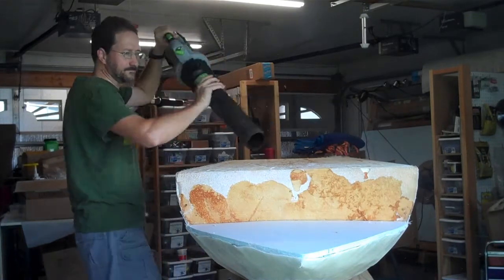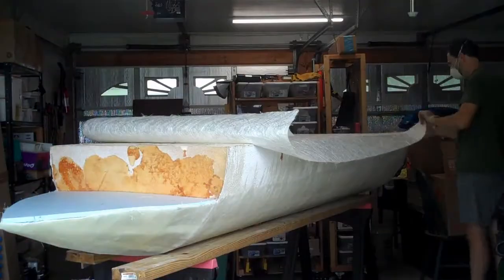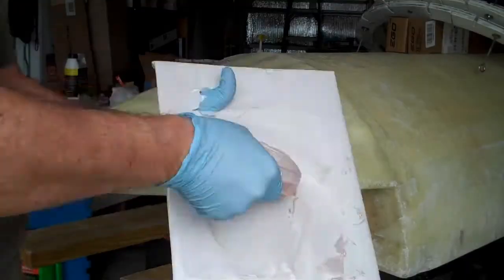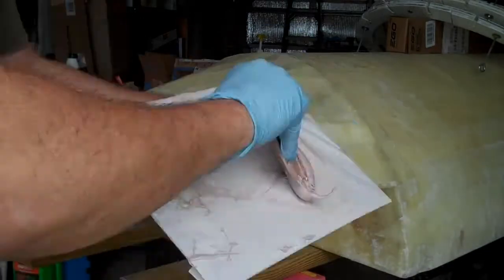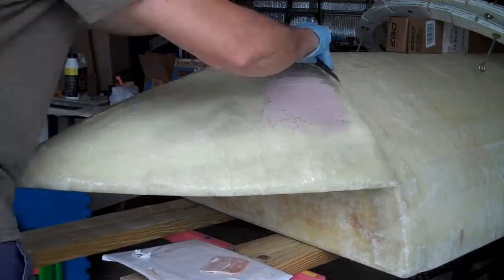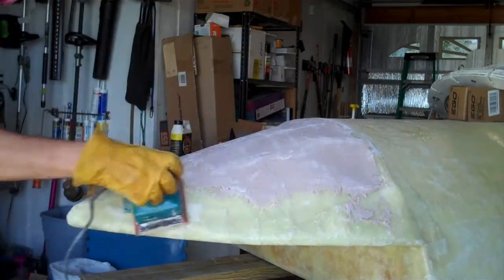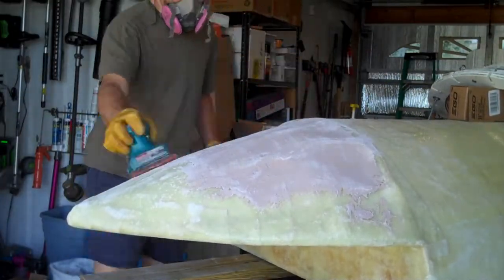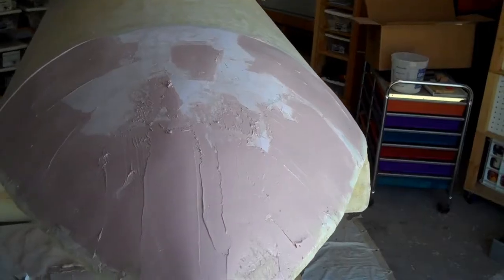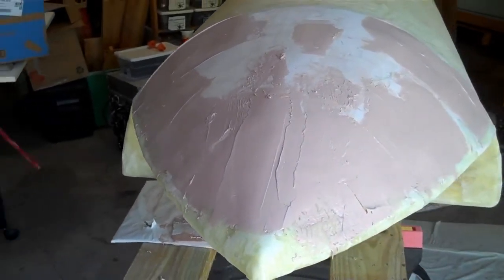For each layer of fiberglass, I make sure the surface I'm bonding to is as clean as possible, then cut the fiberglass to fit the area and dry fit to test it. Because my plastic-wrapped nose cone wasn't very smooth, I had to learn to use Bondo to fill in the low spots. I was initially going to use fiberglass like paper mache, but decided Bondo would be much faster — cured epoxy resin and fiberglass takes a lot of work to sand down. Moral of the story: make sure you're happy with the shape of your core before you start laying fiberglass over it.